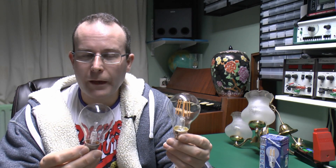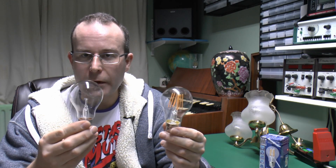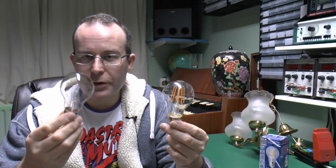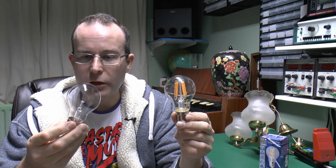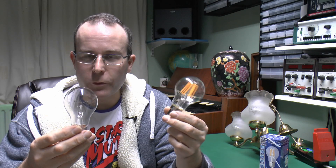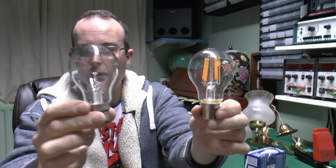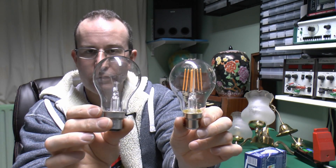So that's the filament LED lamp. As you saw, there's really no difference in terms of light output. The difference, of course, is this is 60 watts and this is only 8 — so dramatically less energy used. This thing ought to last considerably longer as well, given that it has at least a two-year warranty on the box. It doesn't say how many hours it will last, but you'd expect tens of thousands, whereas a typical incandescent might give you a thousand or slightly more depending on how often you switch it on and off. Anyone who doesn't believe that LEDs can now be exactly the equivalent — think again, because there you've got them.